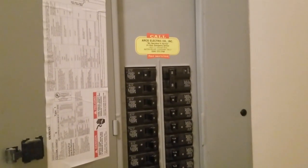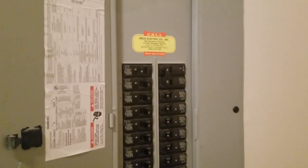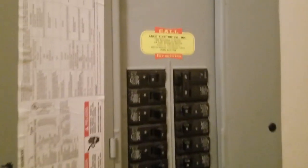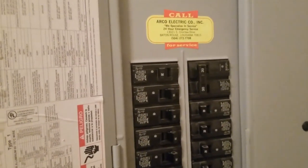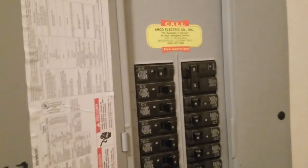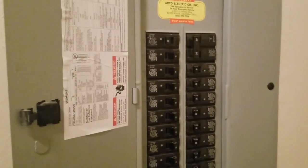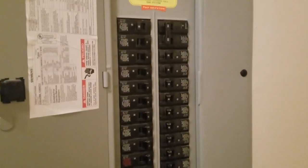This panel is completely disconnected from the grid outside — that panel breaker is off. If I have these breakers on and that dryer breaker on, with the generator plugged into the dryer plug, it is back-feeding this panel. That means everything in this panel I can operate in the house. If we're in the living room we've got all the lights and fans on; in the bedroom we've got all the lights and fans on; in the bathroom you turn on the lights and fans. So everything works.